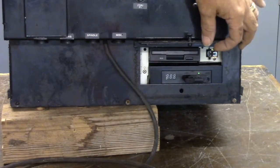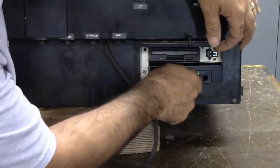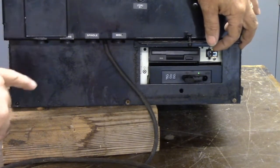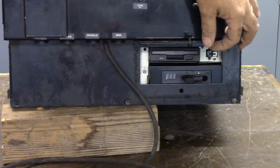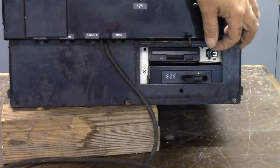This GoTek floppy drive emulator takes a USB stick — it came with a 128 megabyte USB stick. It goes in place of the old 1.44 floppy. When you have 120 megabytes, the software will partition this USB memory stick into — in this case — 85 1.44 megabyte partitions. Don't use the software that comes with this drive; there's a link in the description below to a gentleman on YouTube who demonstrated installing one of these and a source for better software.